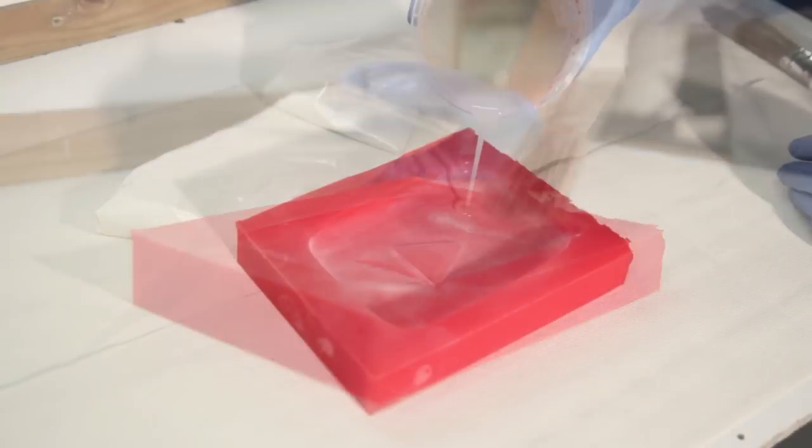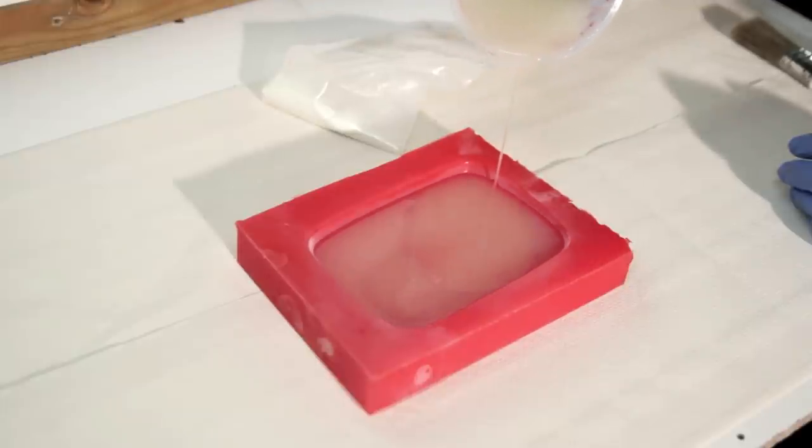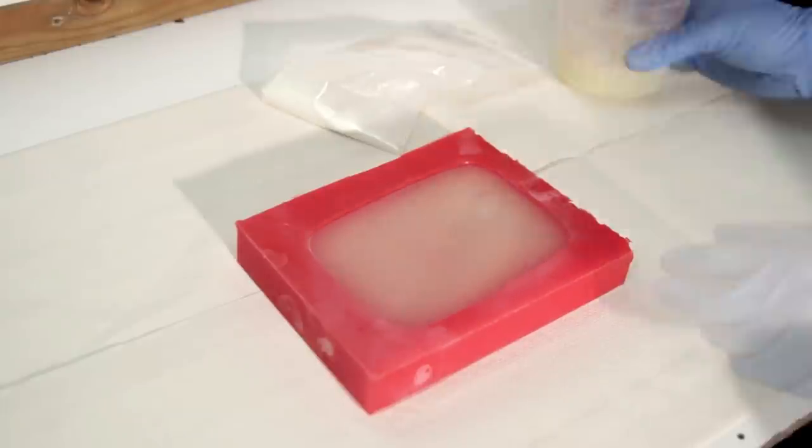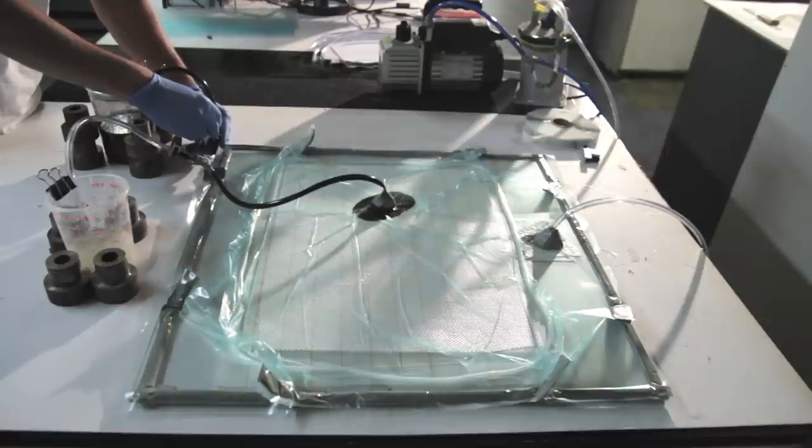So I've seen some guys using some baby powder and so on, just to have less friction between the molds and the resin being cast into it. I'm using the glow-in-the-dark powder and it worked just fine. So just some taps around the molds to make sure there are no air bubbles trapped inside the part.